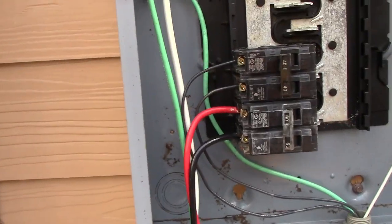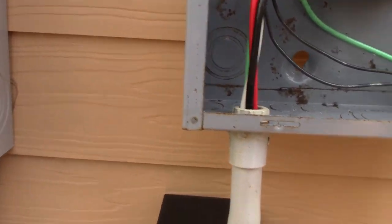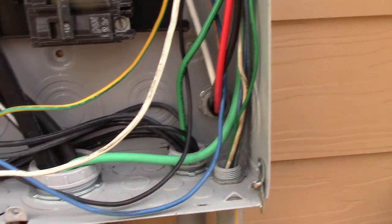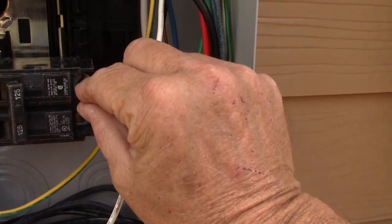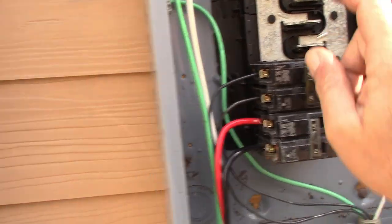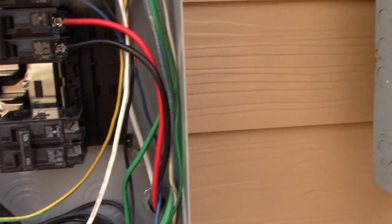This is called a feeder breaker right here. What we've done is connected two wires to the feeder breaker, connected the neutral up at the top, and connected the ground — that comes out through the pipe on the bottom. If an electrician is putting this in your house, he'll come up through the bottom with these wires. The red and black wires connect to the feeder breaker, which feeds power into this transfer panel — that's how this panel gets its power source. The neutral and ground also get connected.